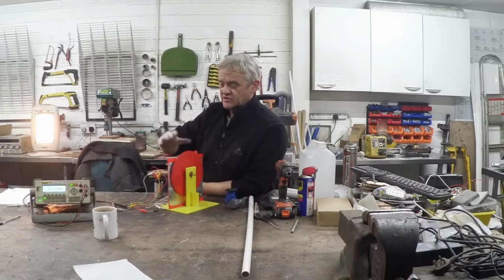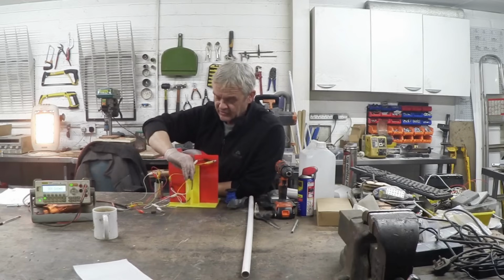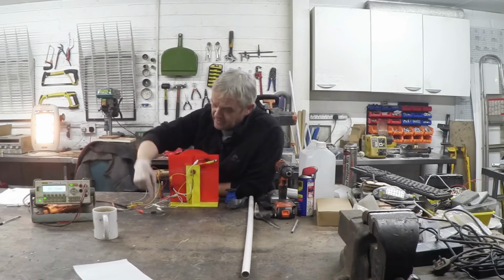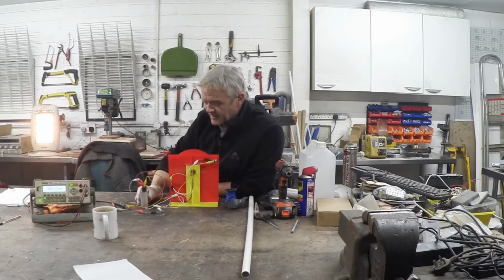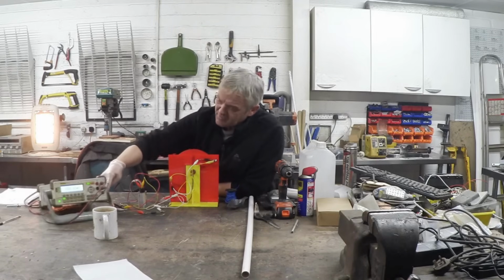So here it is all together. That's really simple. Like I say, that's the disc that we made. There's the two acrylic plates we made. We put it on this little stand here so that we can get it to spin. On the back, we've used exactly that circuit that we looked at. So there's the diodes there, another one there, and the microwave oven diodes. And I've connected them up same way as that circuit. For the capacitor in that circuit, I've used a microwave oven capacitor, and the only thing missing in here actually is the load, but I've connected a meter.